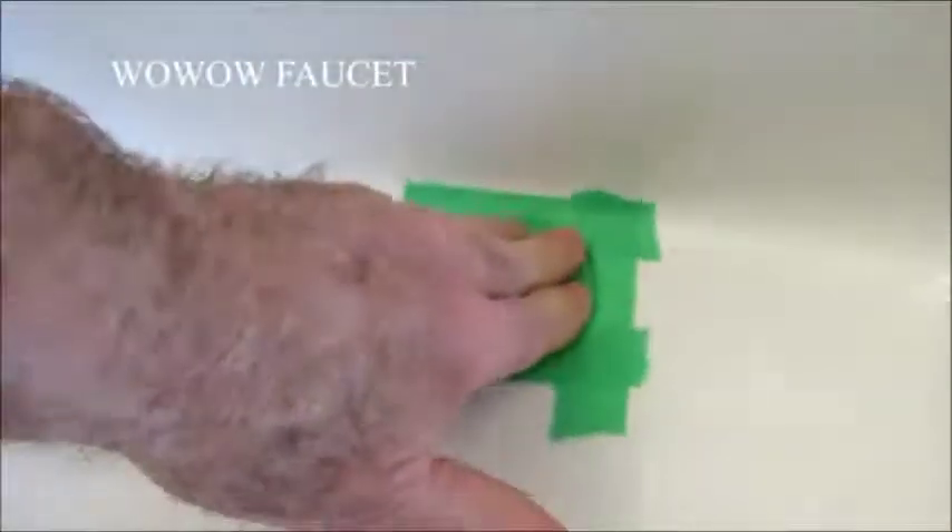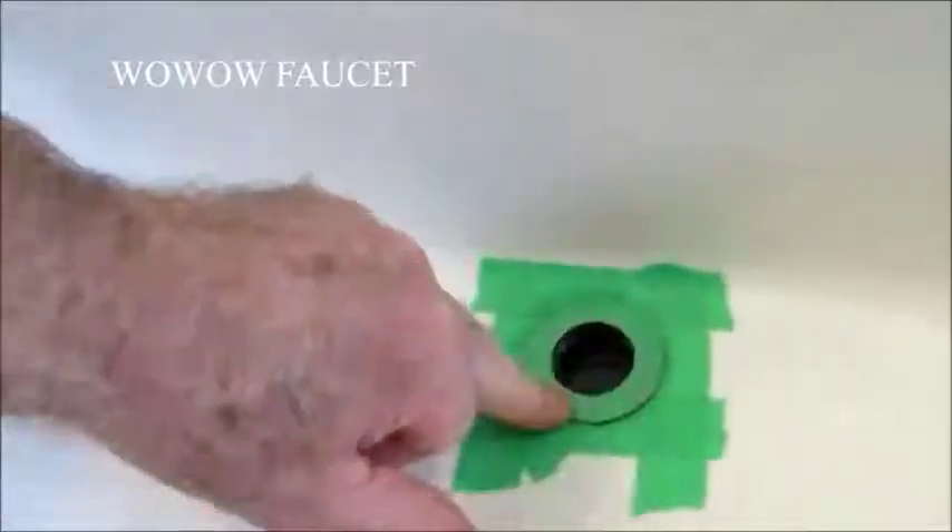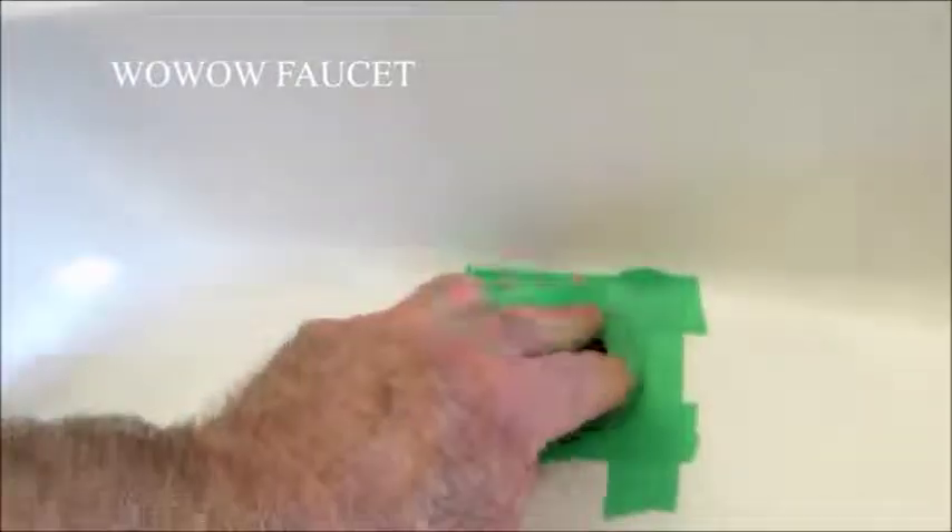We've got our fit. This way, if there's a bit of silicone that squeezes out, you don't want it on this pop-up flange or on the sink base, because silicone is just the nastiest stuff to try to get rid of once you've got it. You don't want it smeared all over the bottom of the basin. This will make for a really slick clean up.